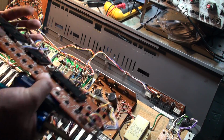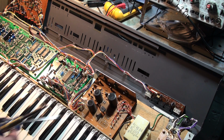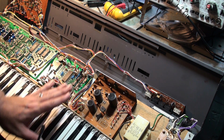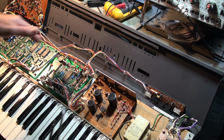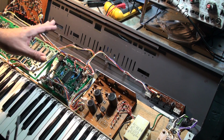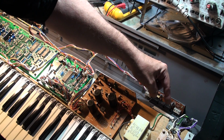First thing we're going to do is flip this upside down. Oh, and let's stop and point this out to you. This is not lying absolutely flat. As you can see, it's going up at an angle, and I have it on some blocks, and the lid is actually open further than you'd normally have it. Another important point: it's not plugged in. Don't do this with it plugged in.